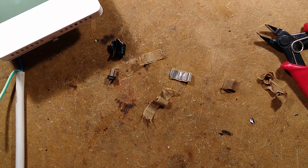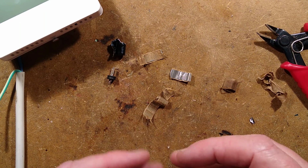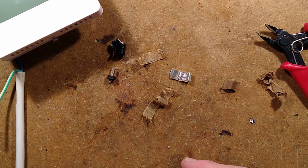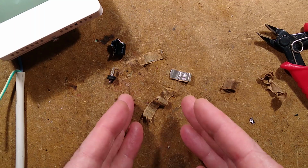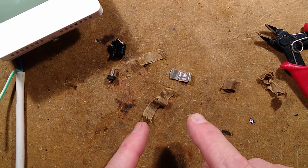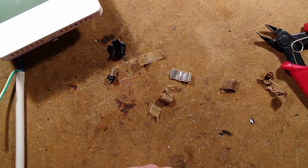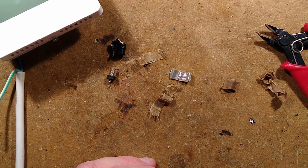So if you have one of these, first suspect is look for those domed capacitors on top, because that's what happens. The pressure builds up. It's the sign that they're going to vent their electrolyte, or that bubbles have formed and it's diminished their capacity. It's a very cheap and easy fix, but you have to use the low ESR capacitors, the ones suited to a very high frequency ripple current, because the switch mode power supplies are really quite heavy on them. But there we go. Good fix.